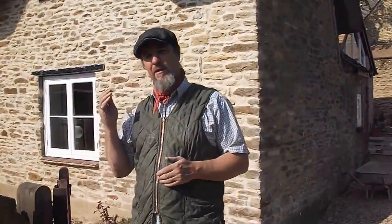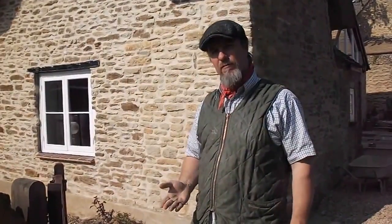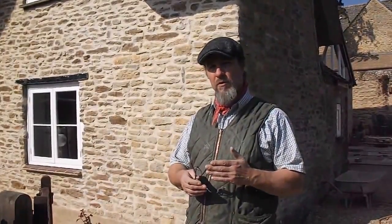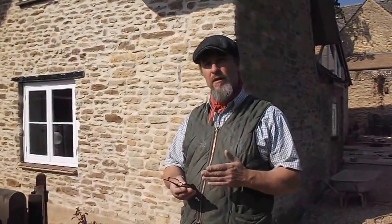This is a 17th century cottage — it's a listed cottage, actually, grade two. When I first arrived on site the stone was tremendously badly perished, very very soft, and so I had to make a judgment call. I made a decision to use lime putty, and the reason for that is because it's softer and more porous than natural hydraulic lime, which I would regard as a bit of a cementitious product. The conservation department are happy with either — it's just a question of whether you have very soft stone and whether you need it cosseted in something soft like lime putty.